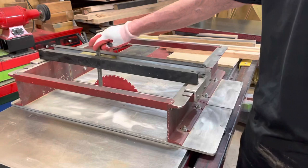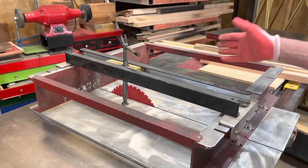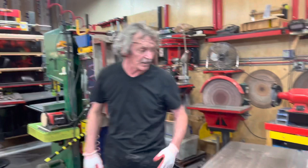That's another tool we recommend in your restoration — on the table saw, put a sliding table with a clamp. It's very easy to do. I think we showed you already the sliding table when we cut some back key felt. This is a general cut — you can clamp anything here and slide it. It's really comfortable and you secure yourself.